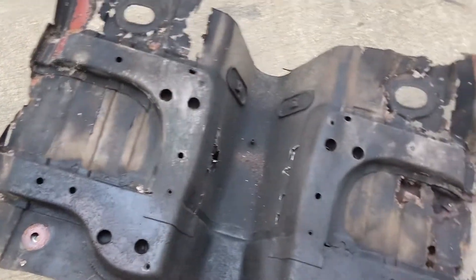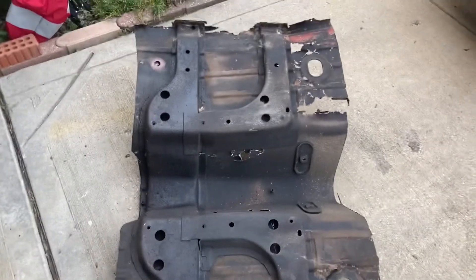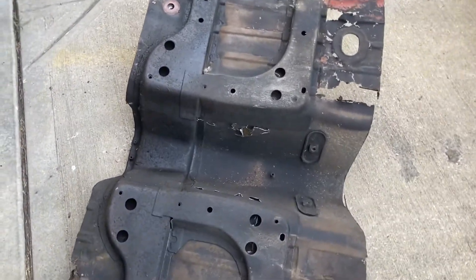I'm going to show the convertible bracing that I've salvaged off what I just cut out. There are actually three pieces — one main piece, a left and a right — and they're still in fantastic condition, so I'm going to reuse those. I cut that center section out the way I did specifically so I could recover those pieces. Got the car all braced up, got the center section of the floor cut out, and the subframe is in good shape — no subframe patching or repairing needed, which is very typical and common on these cars. Added bonus saving some time.